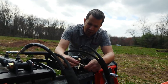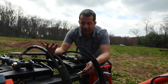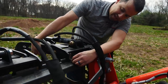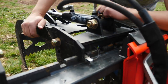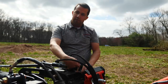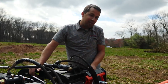There's a unique system that allows you to drop these modules onto the fork frame and lock them in place using these little keys. When you move the modules back and forth, you slide the Grapples on the pallet fork frame and put them halfway between the notches you'd normally use with a pallet fork. There's a hole in the back of the attachment that lines up with the notch in the fork frame. You take the little key, stick it in the back through the hole, and allow it to rotate 180 degrees down — that simply locks the piece in place. When you look at it the first time you'd think it doesn't look very secure, but the magic is the weight of these solid metal keys. The heavy end is always pulled down by gravity, holding the keys in place and keeping your modules from moving.